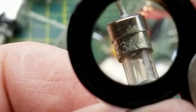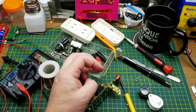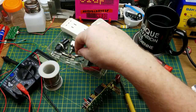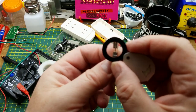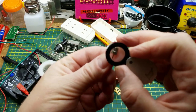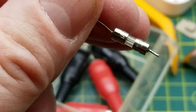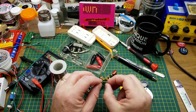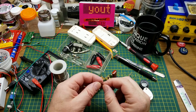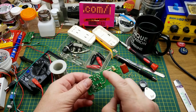There it is - three amps. There's no way a Christmas tree is going to pull three amps, so something heavy duty must have been plugged into this thing in the past. I've got a couple of that style of fuse in my salvage box - both one amp. My Christmas tree is lit with LEDs so I don't think that's going to be a problem. I'm pretty sure it draws well under an amp, so I'm just going to solder this back in after cleaning out those holes.